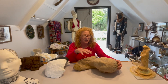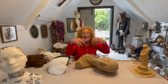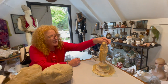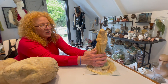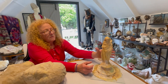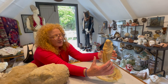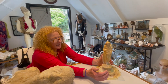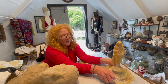Before you do that you need to roughly imagine how many parts your mother mould is going to be. Ideally it's one part which is really easy, and I'm thinking this lady here is a two-parter. We need to divide her around here, and I'm going to slap some plaster on her this side and then let that sit. I'll use some glad wrap to stop it sticking together when the two bits of plaster meet, so we can still butt them up and get a nice tight fit for the second layer of plaster.